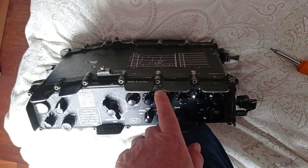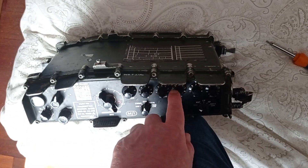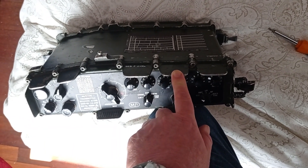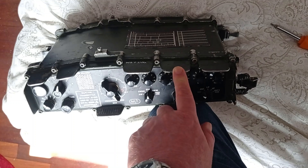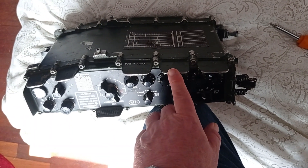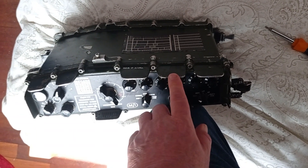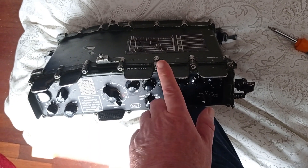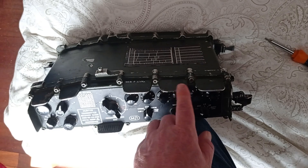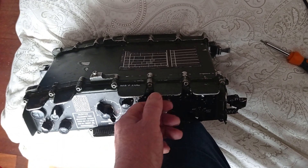So that felt-tip comment on top of the synthesizer module going back to 1985 or thereabouts is still valid — the synth is wobbling. The main thing you notice is it's impossible to decode WSPR or FT8; you just can't do it because it's got about a 100 Hz wobble. On sideband you can almost get away with it — people think you sound strange anyway on a Clansman — but a 100 Hz wobble makes it just a little bit stranger.